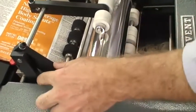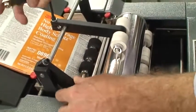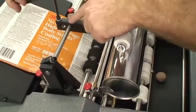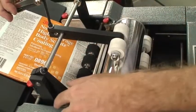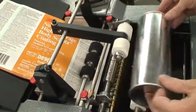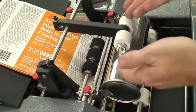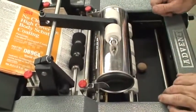Next I'm going to adjust my overhead pressure arm, which is a standard feature on all of our machines. It allows you to do unfilled or light containers. I move the middle arm, loosen it up, and slide it left or right. Then I set my gap for the stop. The reason we do that is so you don't have to lift it up each and every time — just insert the container and it lifts the arm up, puts weight on it, and allows it to rotate nice and smoothly.